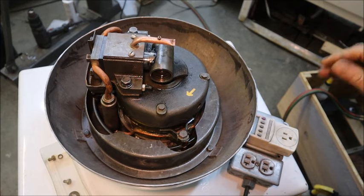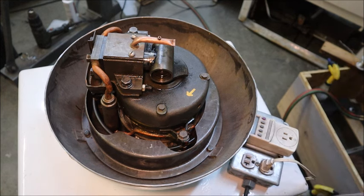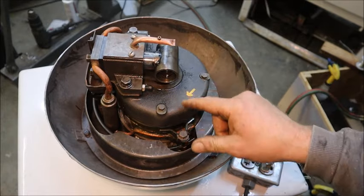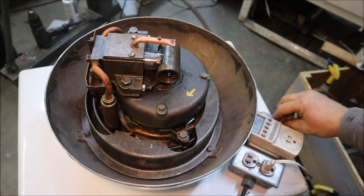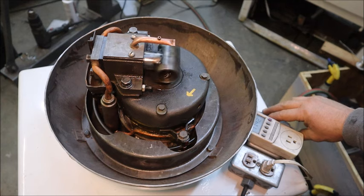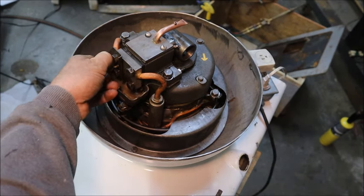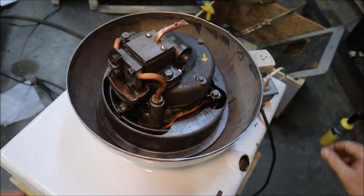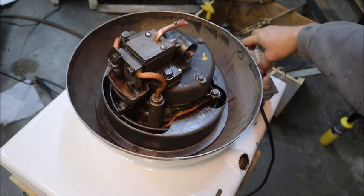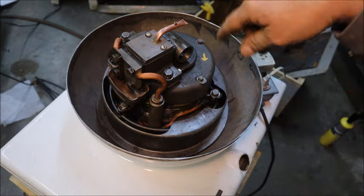That's the last internal part of this compressor and it is technically ready to be covered up, but of course we're going to test it with the top off. The first run is going to be just like the others with no oil in the sump - I've lubricated everything very well so it's not going to harm it for a few seconds. Sounds good to me. The unloader didn't pop out because there's no oil, so starting it again - this is loading, pumping, that's unloaded. The reason for that is to allow the motor to start without compression, and then once it's up to speed that pops out and it has to pump, but it's already got momentum at that point.